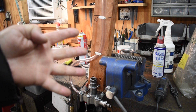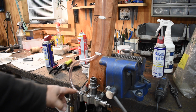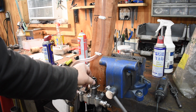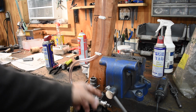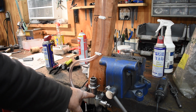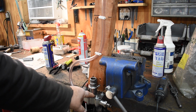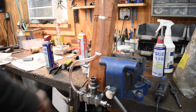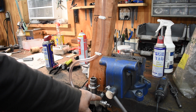This is the fourth iteration of the test. In the first iteration, it leaked like a sieve coming up from around the bottom of the rotary sleeve. It also leaked like a sieve from the check ball. In the second iteration of the test, I did kind of a prototype installation of an oil seal at the bottom of the rotating sleeve and the upper pump cover. The oil leaking up out of the cover stopped completely. This continued to leak like a sieve.